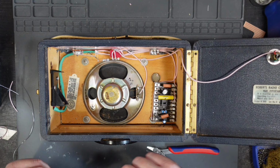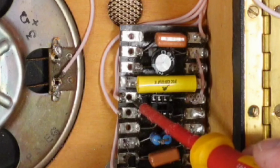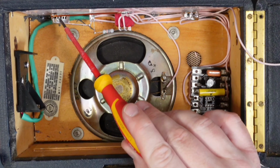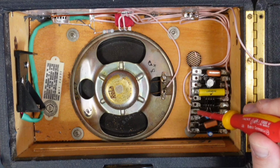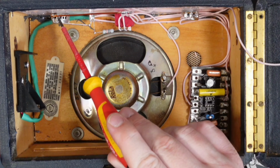It's another example of where I jump the gun and don't look at what I'm doing. That's our gain pot now wired into these 2 connections here onto the board. Next, I'm going to wire up my volume pot, and that comes from this next connection along here, which goes to the center lug of the volume pot.